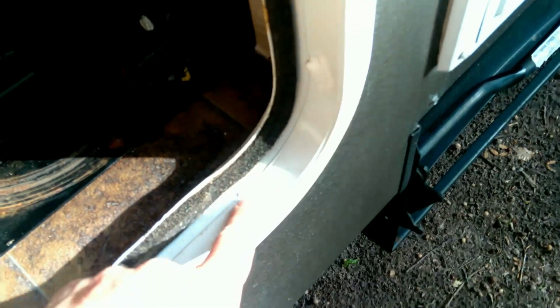All right, I'm not sure where we left off, but what I did is I put this half inch foam all around the edge, bottom too, all the way around, and then I put it around the door too, the top and the sides, and then I stopped it, none on the bottom. And then I put one across the top too, so it could seal up this way. And that's when I found out that this screw was in bad floor, so it was just leaking. So all the water would come down here and leak into this screw hole.